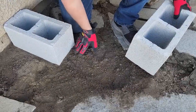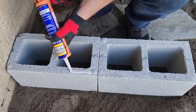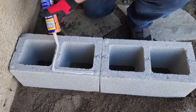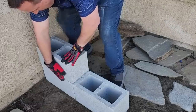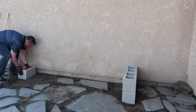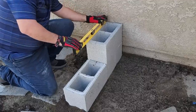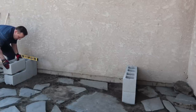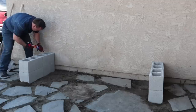First, make sure the bottom is flat and level. When stacking cinder blocks on top of each other, always use an all-purpose construction adhesive to hold the blocks together so there's no slippage. On a project like this, always wear gloves. Lay and stack four cinder blocks together — do this for both sides — then take your level to make sure everything looks good.